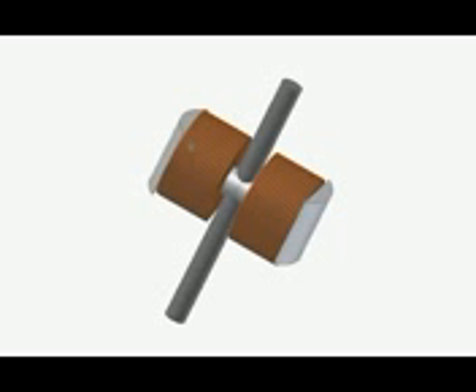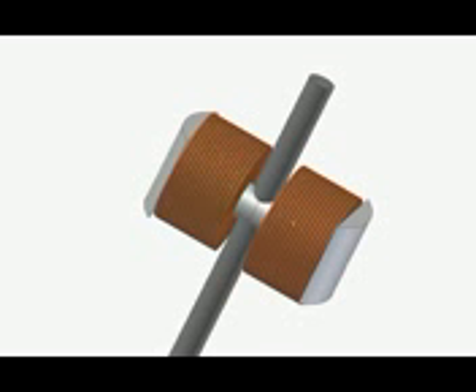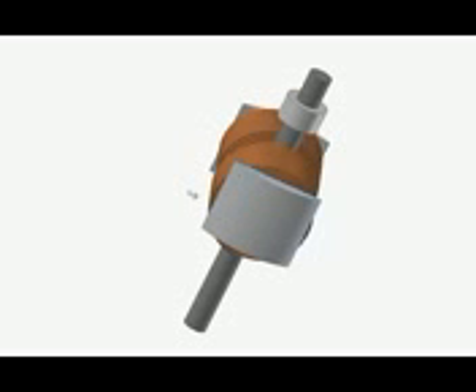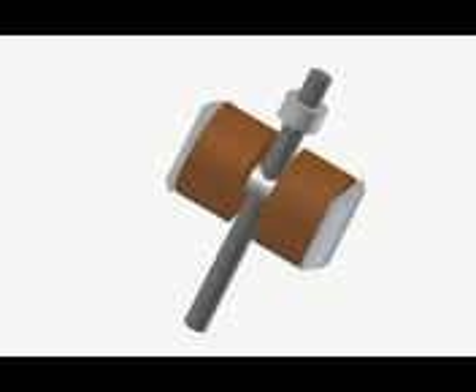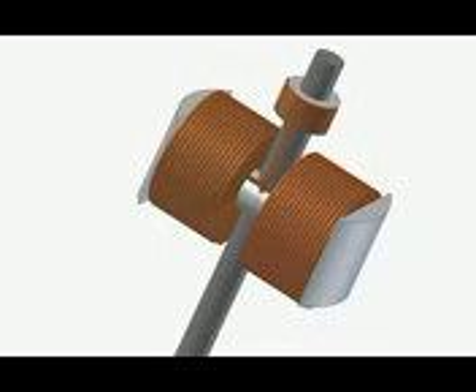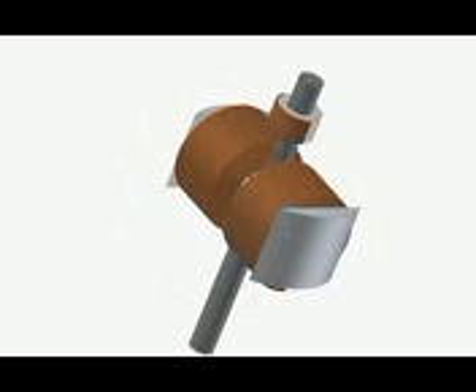It's time to give some power to the coils — this is the tricky part of the DC motor. To provide power I need to build something called a commutator. The commutator is actually a ring, placed above the electromagnets and fixed on the shaft. This ring rotates along with the shaft and is made of non-conductive material, which is very important. On the perimeter of this ring there are two parts made of conductive material. This is the first part of the commutator, and it must be able to withstand friction — at higher revolutions you will see later why.